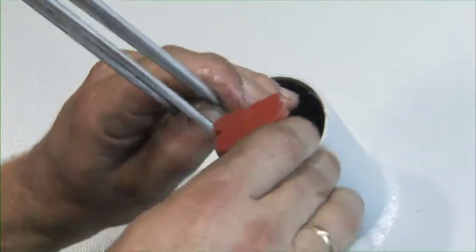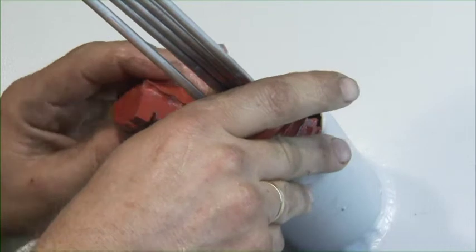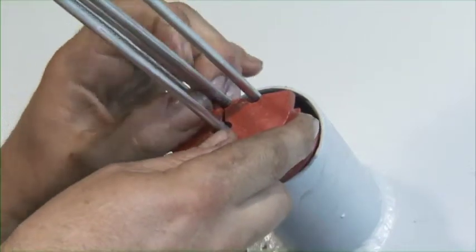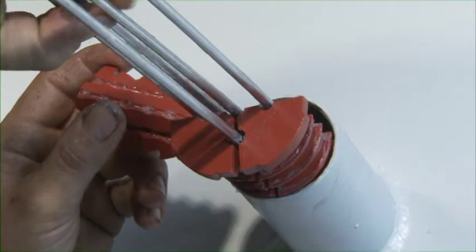The lower 2 segments of the 5-fold multi-plug or the lower segment of the 2-fold or 3-fold multi-plug are placed under the pipes and pushed into the conduit as far as the first serration. The first serration is smaller than the other serrations to allow positioning of the plug into the conduit.